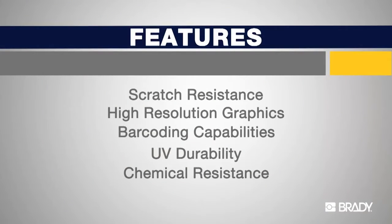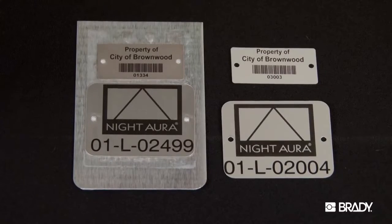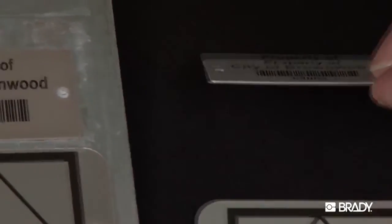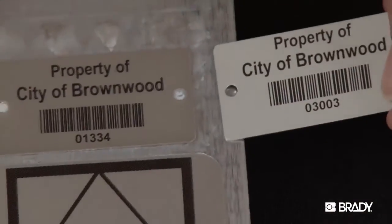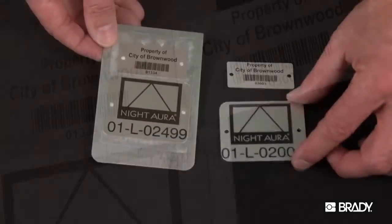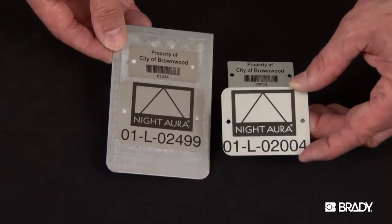Another important aspect of Metal Photo is its UV durability. The image is actually silver — because it is not a dye or pigment, it will not fade. The samples on the left were exposed in a QUV laboratory accelerated weathering deck for 10,000 hours, representing approximately 30 years of outdoor weathering exposure. On the right are the unexposed control samples. Traditional surface printed materials will typically start to fade after 5 to 10 years.